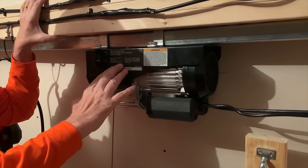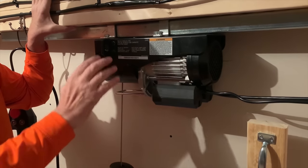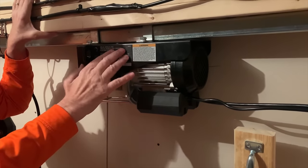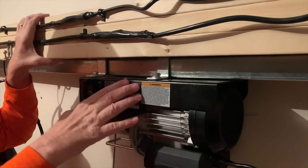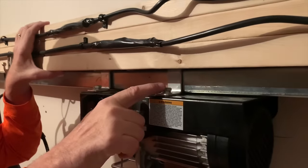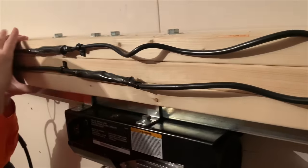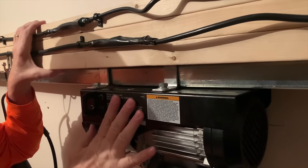Let's talk about the motor. It's an industrial strength motor with a 550 pound capacity — it'll do 1,100 pounds with a snatch block. 550 pounds is more than enough to pull whatever I'm going to be pulling on this elevator. This is a really high-quality motor. The first concern was how to attach it so it's not going to come off. Almost every one of these motors comes with hoops on top, and so does this one. I ultimately decided to use leftover super strut channel to secure the motor to the channel, then secure the channel to the beam. I used six pretty significant bolts through the channel — four close to the motor and two on the ends — and it's more than enough to hold the motor in position.